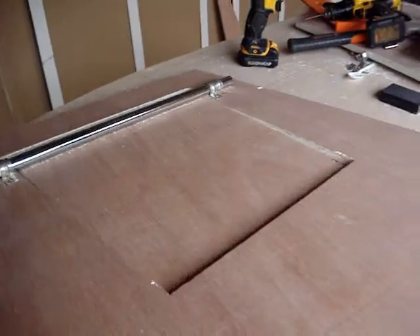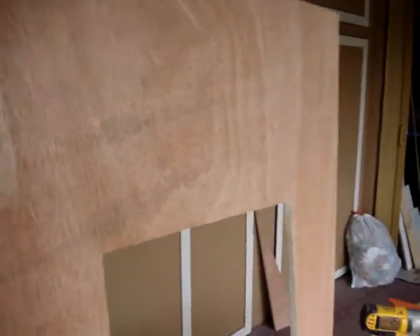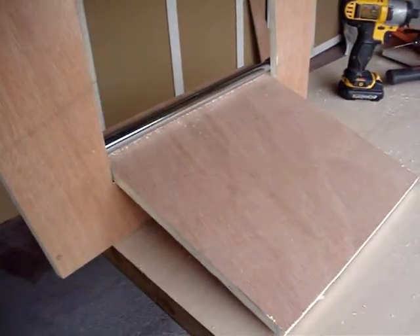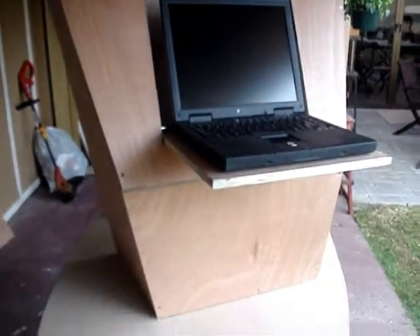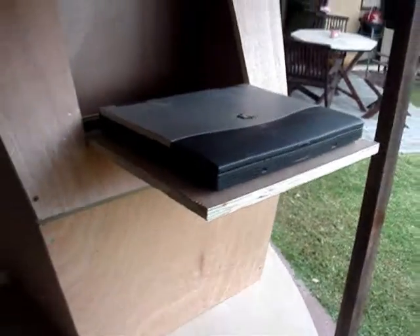This is how I mount the door. I use a pipe with regular EMT clamps. I end up changing those clamps out for clamps that have a screw hole on both sides to make it stronger. I recess out the back side of the door so it doesn't hit when it opens. By using this bar in this manner, it has a natural stop when it opens up.